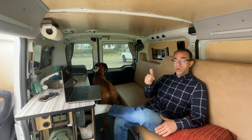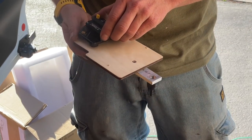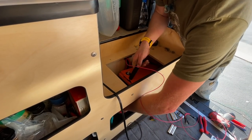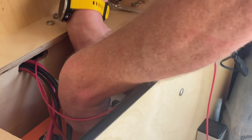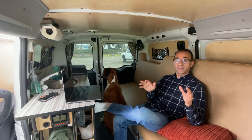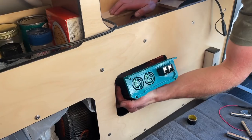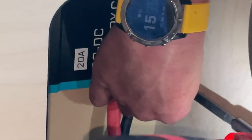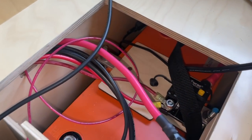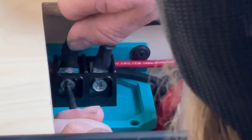I'm okay with having my battery at 90% rather than 100% all the time — that's still more than I had before. I'm very happy with the extra solar panel and the lithium battery pack. One thing I forgot to mention: the battery has an app that shows percentage, amps in, amps out, and battery temperature. It's mind-blowing. And now I can go to cold climates without worry — if the temperature drops below 30 degrees, like in Colorado, the BMS will activate a heating element so the battery can still charge. I get all of that right on my phone.